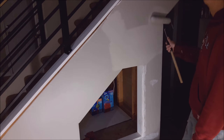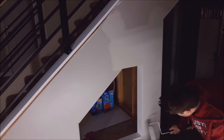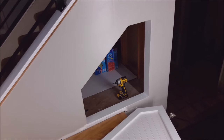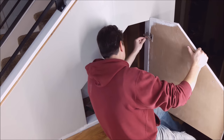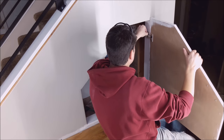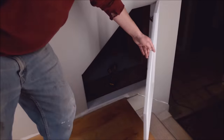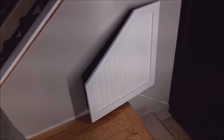As always, there's going to be a little touch-up required, and don't feel bad if you've got to touch it up three or four times. If you've never put in hinges before, don't be scared of it. All of the packages come with templates that tell you exactly what and where to drill — it makes it super easy to align the screws and makes it go flawlessly. And of course, they are the typical soft-close, which everybody loves. I'm betting my kids are going to have those worn out in probably less than a month.